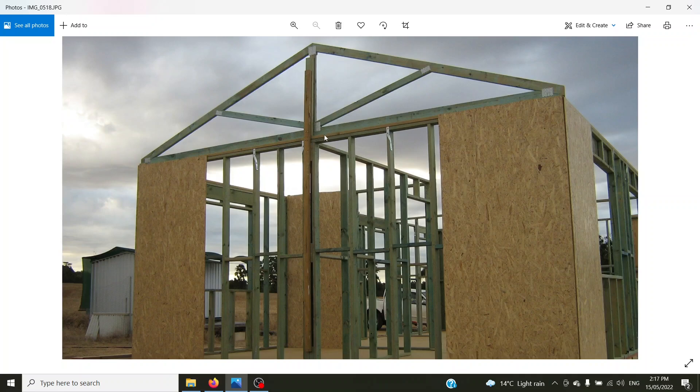When the wall frames went up there was a timber here — you can see it in the green — and then top plates went all the way around. The purpose of that is to get overlaps on your joins and stop it from pulling apart and get extra strength for your roof loading. So there's the first one up in place.